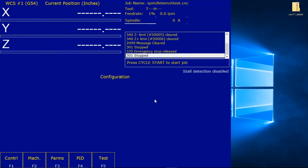Configure encoder counts per revolution. The encoders need to be set up for the correct number of counts per revolution. A quadrature encoder line count is multiplied by 4 to get the counts per revolution. For typical Centroid DC servo motors with 2000 line encoders, the correct setting is 8000 counts per rev. High resolution encoders, 10,000 line, are 40,000 counts per rev.